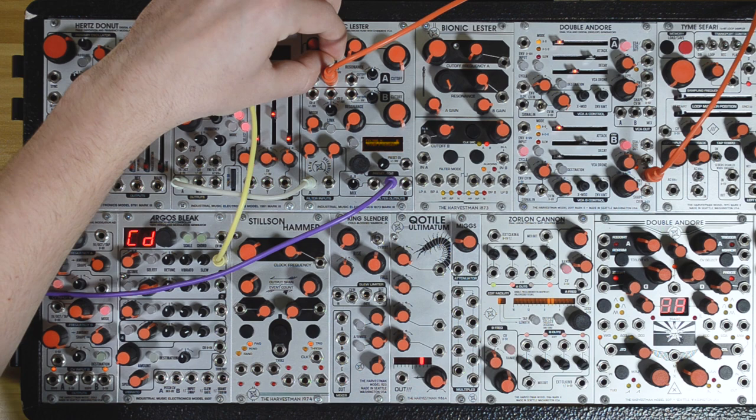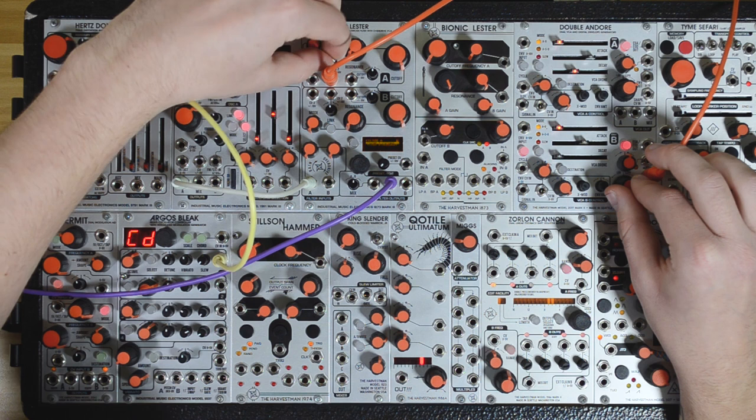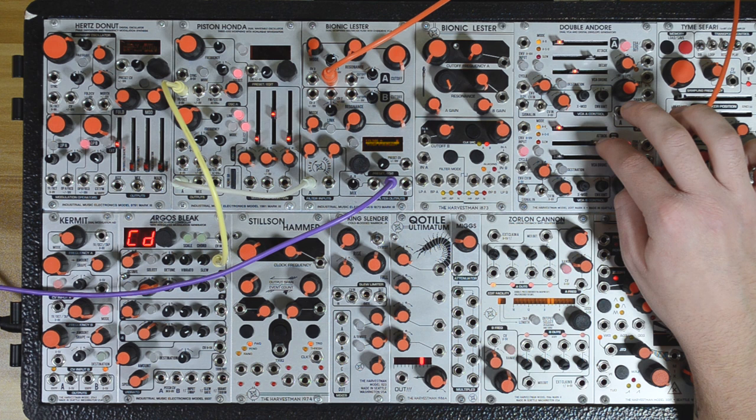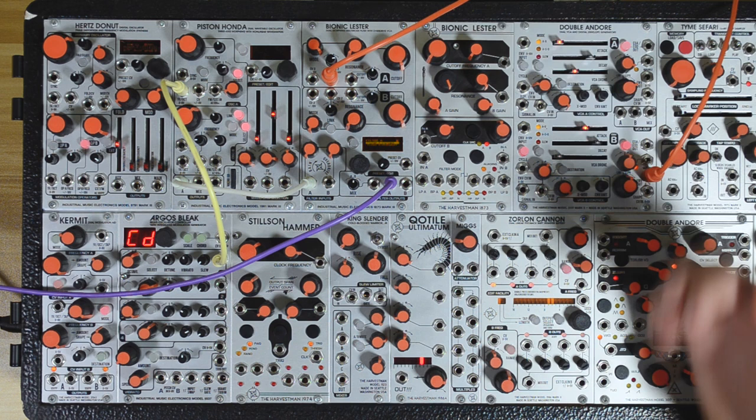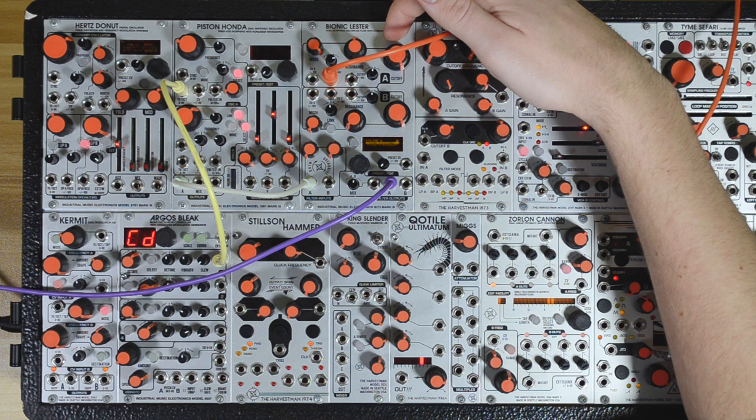Note that the attenuverter level is important when choosing if your upper limit reaches into soft and hard clipping. Bringing it down ensures that the spike only reaches unity gain. The comb filter modes work particularly well with a pre-filter VCA, as we can control the impulses sent into the resonator.